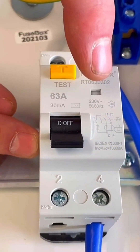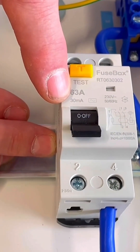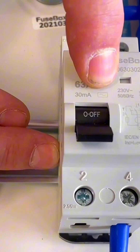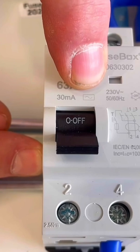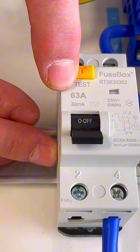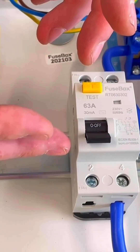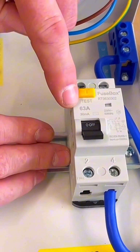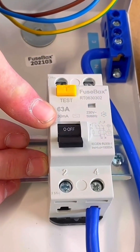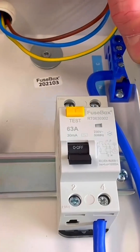This works as that purpose but it also is an RCD — an RCCB, residual current circuit breaker — and it's rated at 30 milliamps, so it will offer additional protection for the two circuits that you can wire from it. It's also an AC type, and we know how we're trying to move away from AC now to the A type RCD as a minimum. The switching value or rating of the actual device is 63 amps.